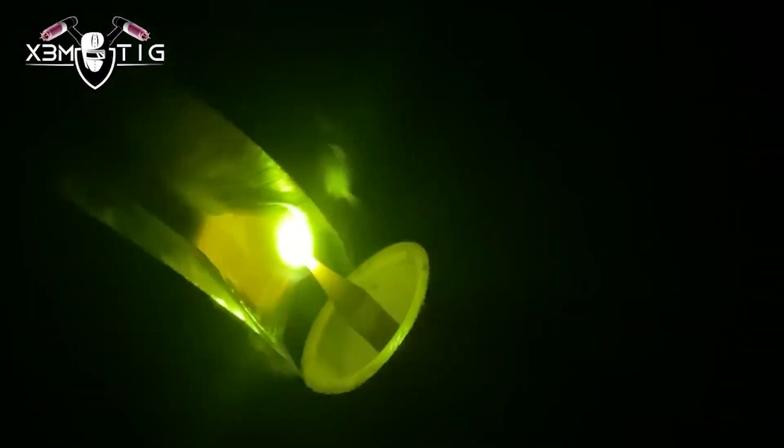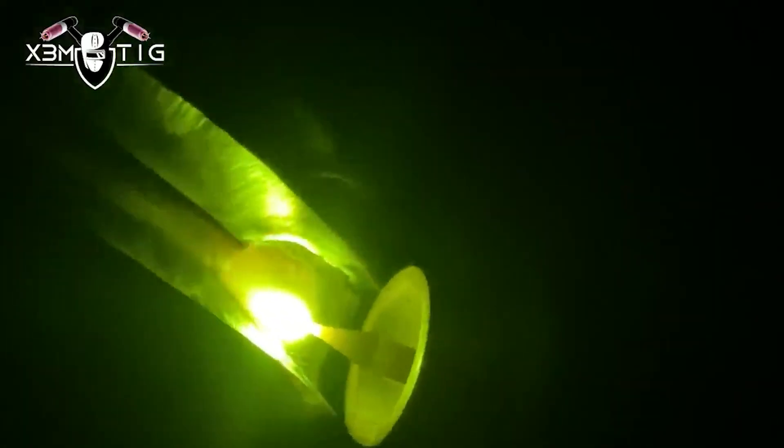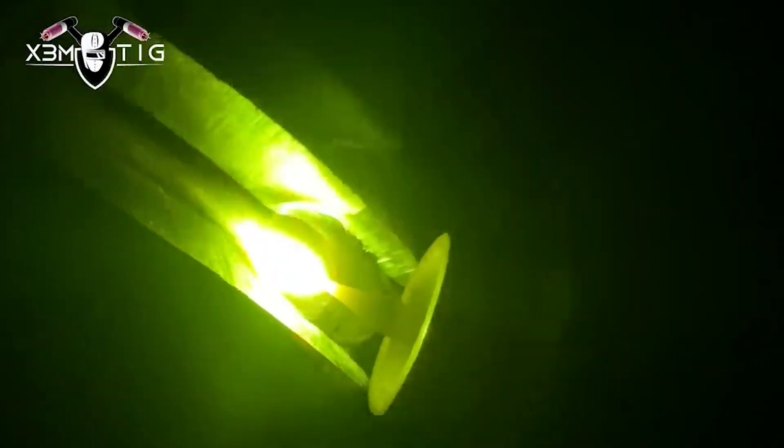That's the root — it's a little bit heavy, which is pretty much what I like. If you watch my previous videos, I like a heavier root. But the main thing is to have your root consistent and uniform all the way around. If you like a heavy root, try to keep it that way all the way around so you don't have much oscillation in uniformity or thickness, which helps later for your hot pass. If you go with 3/32 rod and a shallow root, you might experience suck-back — that's why I like a heavier root.